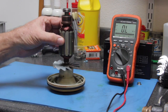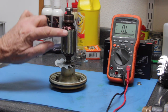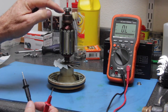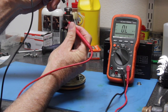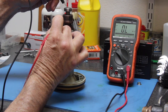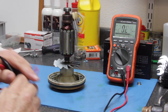This is a steel covering, and it is a series of metal pieces that are laminated together. As opposed to being a solid piece, there are better properties by laminating these thin layers of steel together. First off, we're going to make sure that the commutator is not grounded out. The shaft is considered the ground. We're going to touch each one of the segments on the commutator and go all the way around to make sure none of these segments are grounded out to the shaft of the armature. If your shaft is grounded to the commutator, you're not going to get a proper magnetic field on the armature. That's test number one.